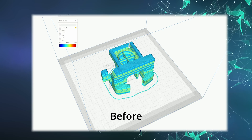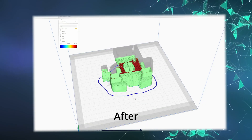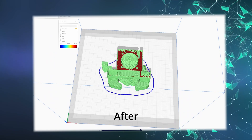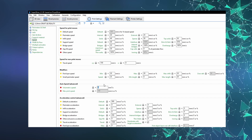These are some pretty good results, so let's apply them in the slicer. We can do this by tweaking our print speed settings so that the maximum flow rate achieved during the printing of a part is the same as the maximum flow rate our hotend can achieve stably. In SuperSlicer, this can be done quite simply by typing in the value.